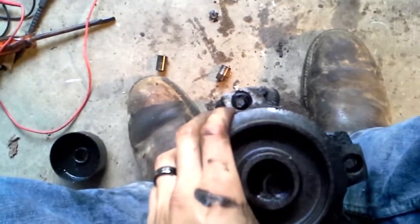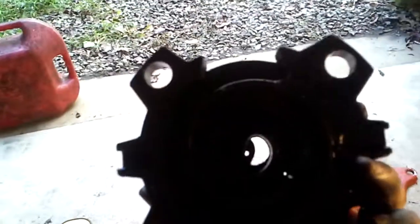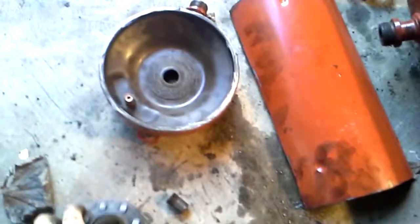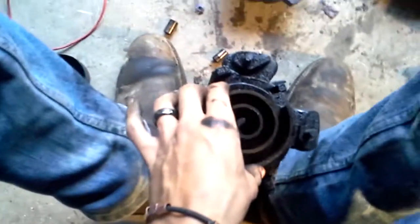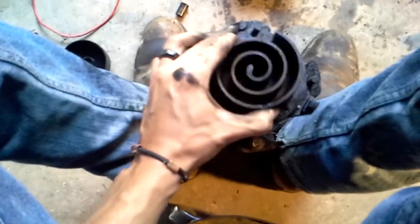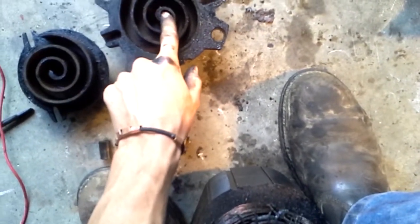These are the bushings that go on top — even though this is a fixed portion of the scroll it still has to move a little bit. This is the inner scroll — pressure comes through that half-moon opening, and the other little hole is the relief we just removed. As the bottom oscillates it builds pressure, comes up through the center, the steel seat pushes gas out. It comes in through the suction side, gets compressed as it works its way around, and exits out through the center. The oscillating scroll just goes around the inside of the stationary scroll — that's how it builds compression.